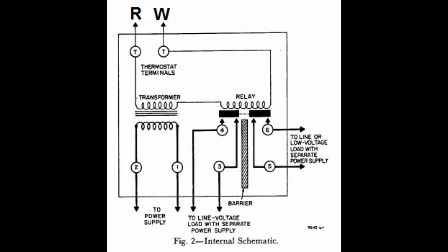This is the schematic. I originally wired the Nest with the two wires going to terminals R and W. The unit powered up and operated okay, but I had to tell the Google Home app that I had a C wire, otherwise it wouldn't let me proceed. It worked fine, but it indicated an error condition because there was no C wire — a minor annoyance. Also, because there was no C wire, every time the Nest activated, the closing of the contacts caused it to lose power since it was in effect shorting out its own power supply. I figured if the heating cycles are short enough, it wouldn't be too much of an issue if the internal batteries can hold out.